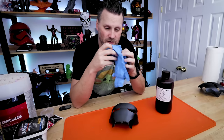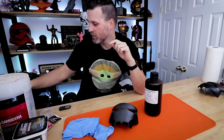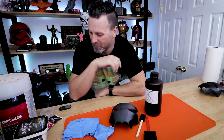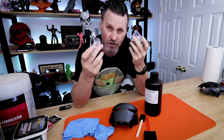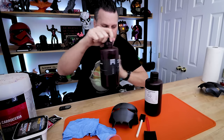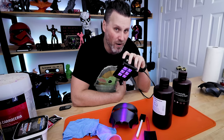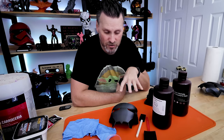To get started, we're going to need a few other things. We'll need gloves — obviously if we're working with resin, you don't want to get it on your skin. I'm going to be using foam brushes since I don't have any chip brushes readily available. I also have little jello shot containers from Walmart for pouring in the resin. And I'm going to be using a UV light for curing. If you don't have one, you can just coat your print in resin and sit it out in direct sunlight to cure.